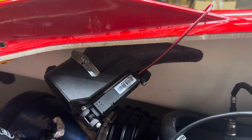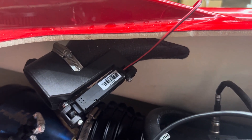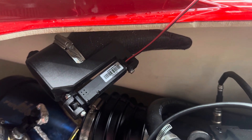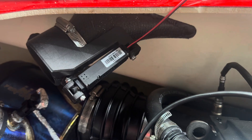Once you get your clamp on there tight, make sure you go to the front of the vent and check that you don't have any silicone that seeped through the front. You don't need to put a whole lot — just a little bit to add a more secure bond — because you don't want your flange to not open and close. So make sure you don't have any silicone that seeped through the front.